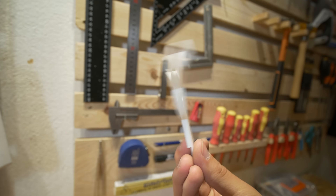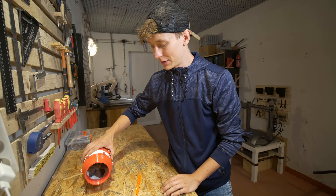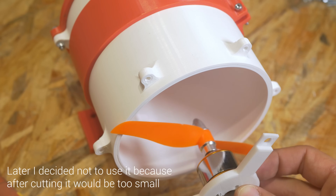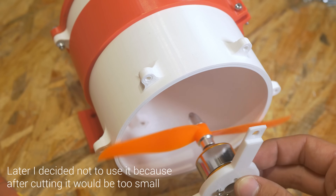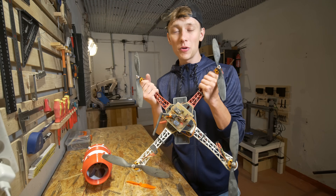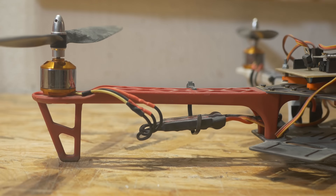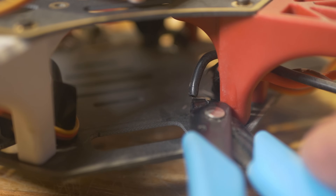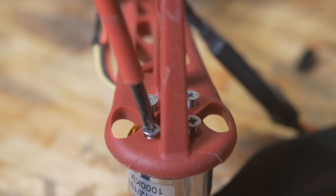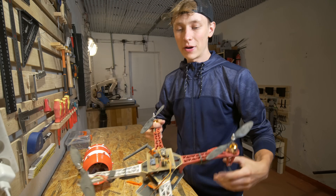The new motor mount is ready. I'm already printing the fan with a different shaft diameter, and for now I'll test with a propeller I had to cut because it's just too big to fit inside the tube. If you've been following my projects long enough, you may remember the Ludwig drone — it's pretty dusty. For now it will be the source of parts: I want to use the ESC and the motor, because there is a BEC (Battery Eliminating Circuit) inside the ESC, and I'll use that to power my Arduino.